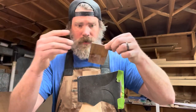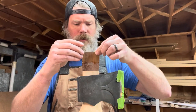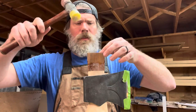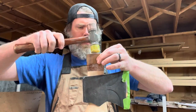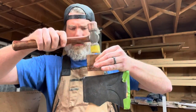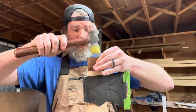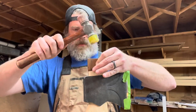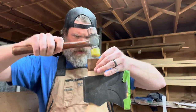Positioning — I said this is stressful, it's stressful. Because you don't want to mess it up and you're out of time with the glue. So kind of set that up there. I'm pretty happy with that front to back. Got to start driving it — want to make sure I don't get stuck on the inside of the curve or the outside. Mostly you want it on the outside because this is going to go, and this is going on pretty nicely. Not using that much force, just kind of tapping and getting it going. You can hear it start to crackle and pop a little bit — that's just a little stress on the wood, it's not getting any cracks on there.